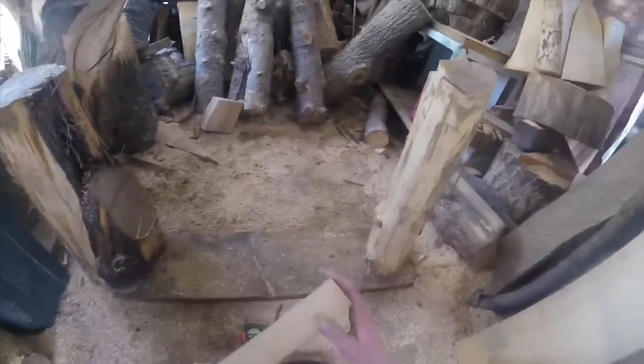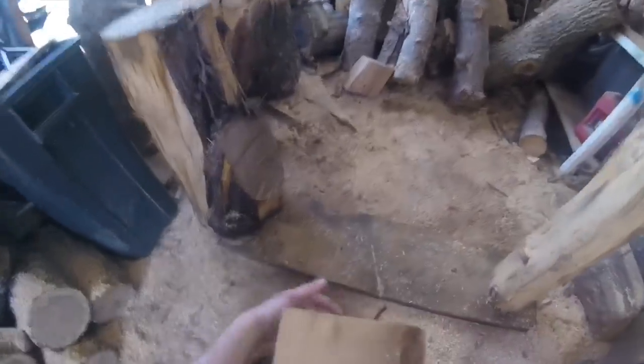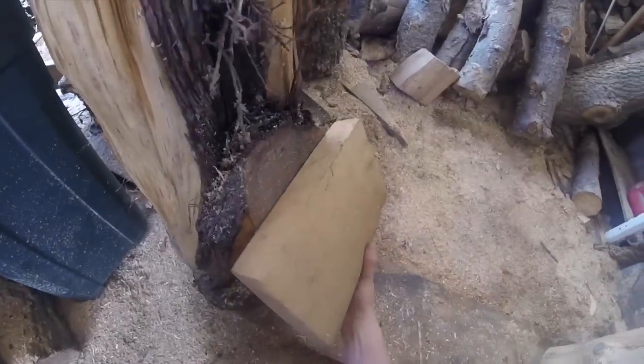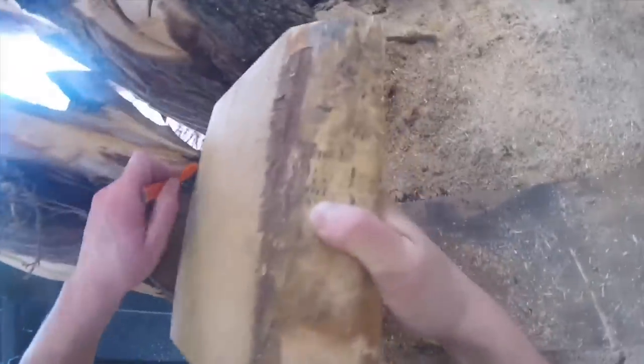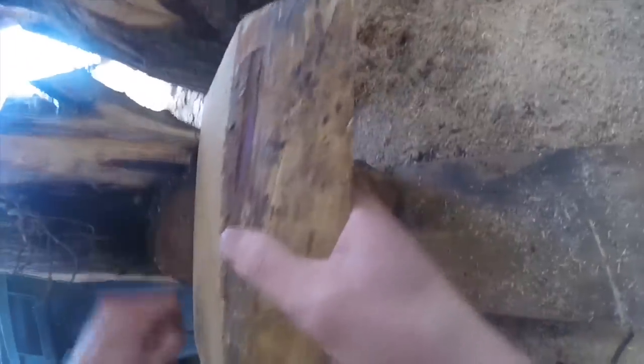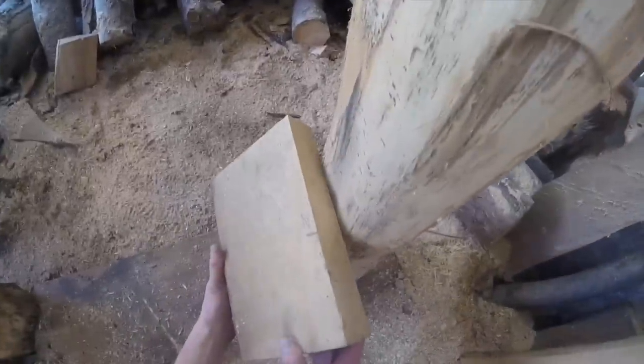What I like to do is grab a scrap piece of rough cut, because that's what we're using. I already know it's 2 inches, and it's easier to handle. So I'm going to line that lower line up with the bottom of the board and make the top mark. That ensures it won't be too awful wide. And if you use a pencil or a crayon, there's our 2 inch thickness. Come over here, do the same.